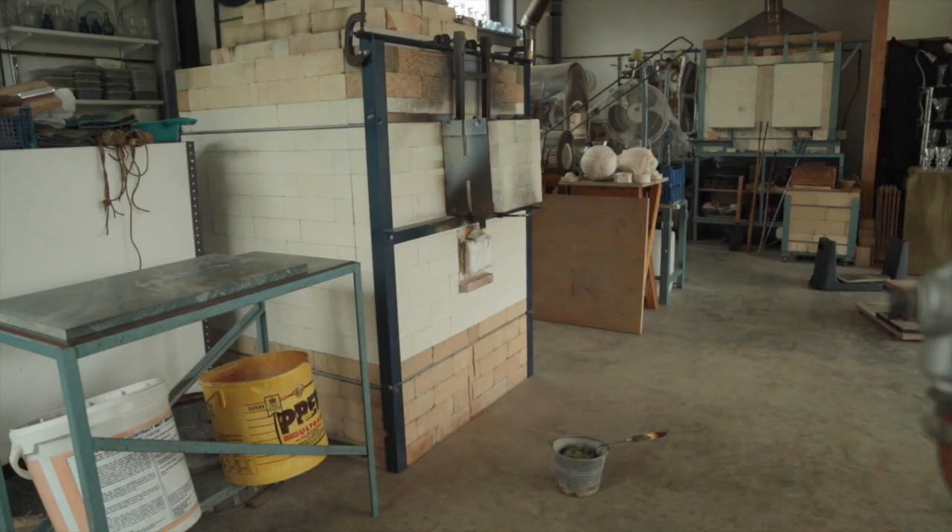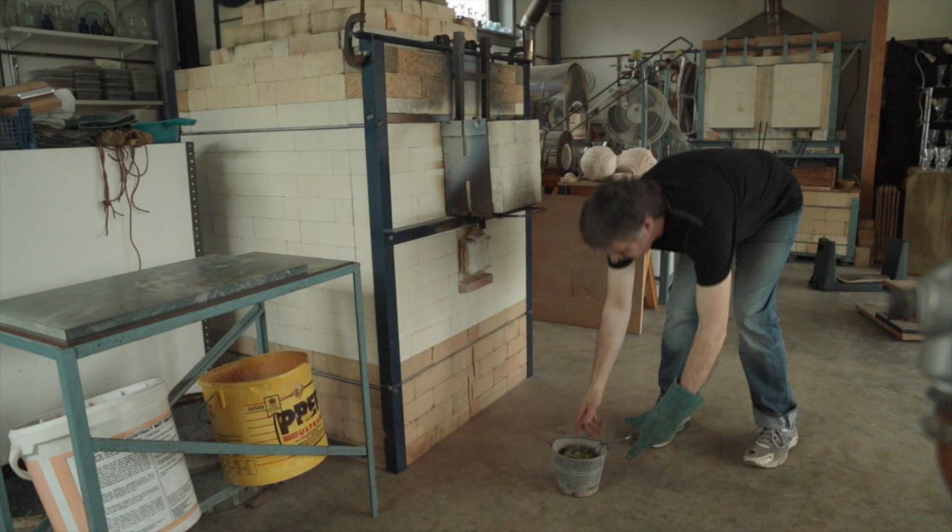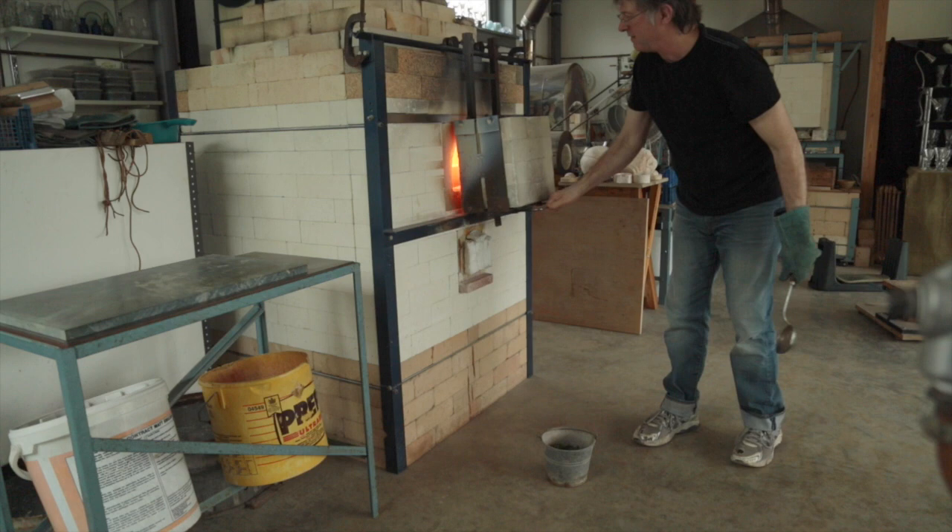The process of making glass, in this particular case for making circus beakers, is to melt crushed glass or cullet. I do that by shovelling the broken glass into one of the pots in the furnace. Leave it for about 12 hours at about 1300 centigrade, and the next day we have glass which is workable.